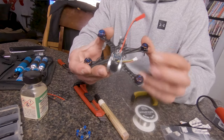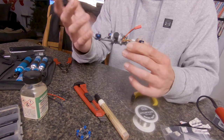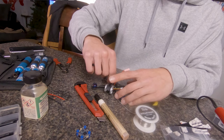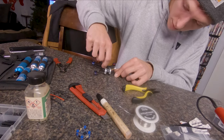The motor wires are now soldered up to the ESC - these are some of the tiniest wires I've ever soldered as far as motor wires go. If you're a beginner builder, I would almost have a buddy help you with this because these pads are so small - I bridged a bunch of pads and capacitors a couple of times. If this is your first build, definitely look for help with the soldering. There's not a whole lot of soldering because the stack has pins between each layer, but there is soldering for the motor wires, camera, and receiver.